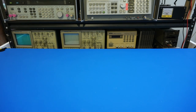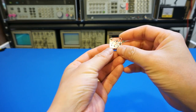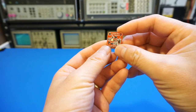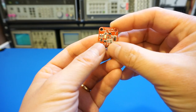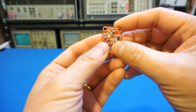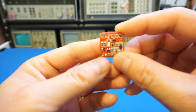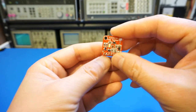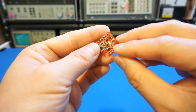So then I found this TCS34725 based RGB light sensor. This module is actually quite popular for Arduino projects, which only costs a few dollars on eBay. And I think this just might do the trick for this project to capture the color image instead of a grey scaled one. And as a bonus, this one already has a library on Adafruit that can be readily used to drive the project.